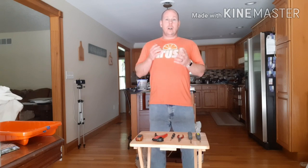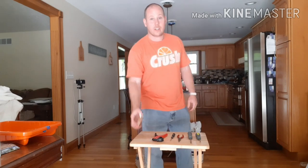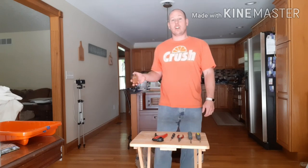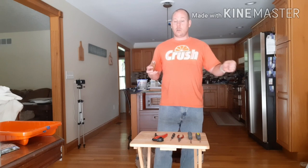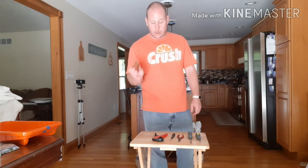If you're looking to figure out which breakers or fuses go to which areas in your house and you don't have somebody to help you, I've seen electricians use a small device — very similar to this outlet tester — that plugs into outlets and basically has an alarm. That way you can plug it in a room, go to your breaker box in the basement, and start flipping switches. When you hear the sound come on or off, you know that switch relates to that room.